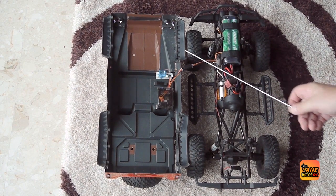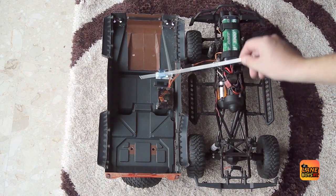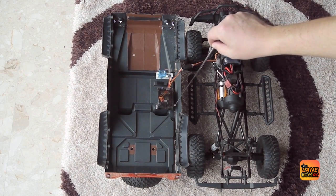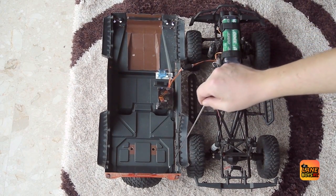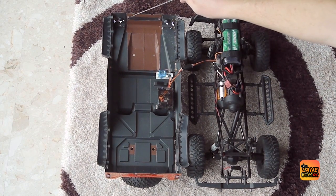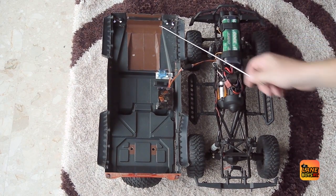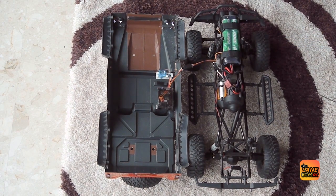The slave light controller is controlling this tiny steering servo here that connects directly to the steering wheel, and also all the wires are running around the body to the individual LEDs in the front and the back. For the wiring I used enamel wire, which is very tiny and isolated and easy to solder, and is ideal for this kind of job because even a strand of 8 wires is only about 1 millimeter in diameter.